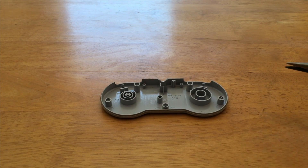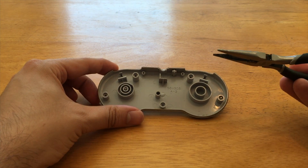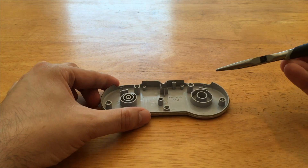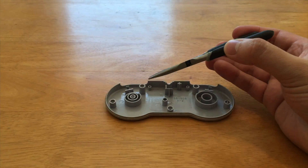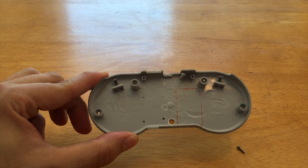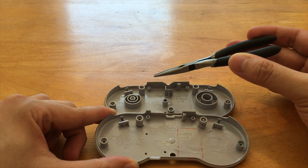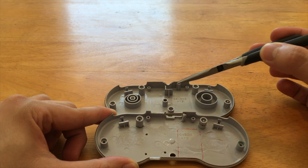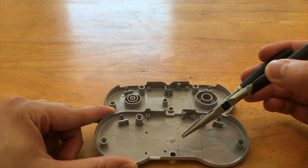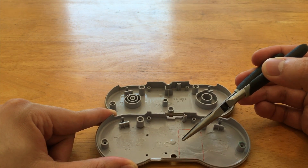The standard Super Nintendo controller has material on the back to keep buttons pressed in place for good action. But that's the space where I want to store the Raspberry Pi, charging cable, and battery, so you have to remove it. I removed those pieces, removed an unneeded pin post, and removed the piece at the top to get the HDMI cable through. There's also a post for another screw hole that you don't actually need — the other four screws are enough to keep it closed.